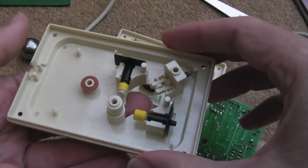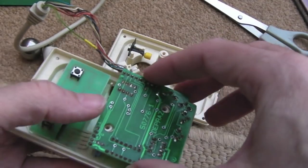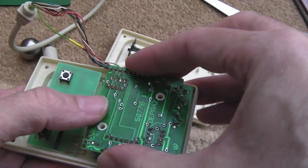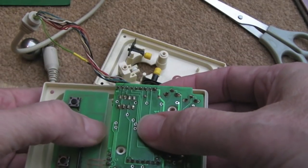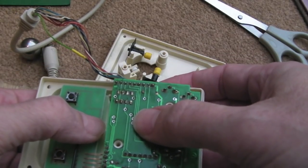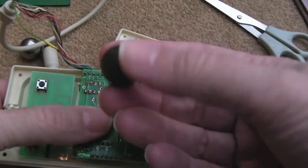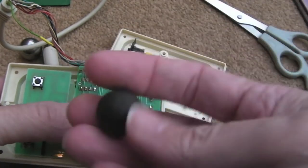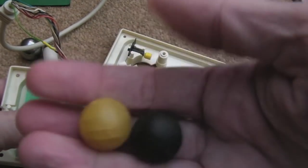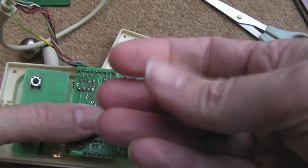I've not even got the thing in there, I've moved it around and it works. It rotates in all directions and it's got a really good weight - gives the mouse a really nice weight. No worries at all, that's not going to wear, for sure. And if you've got the heat shrink things on the rollers like this it makes a perfect fit - can you see those rotating? Sweet. I searched for various things - rubber balls, toy balls - I couldn't find anything in 20mm. You can get replacement mouse balls for the more common size which is 21.5 to 22mm, but they won't work here. These are 20mm.